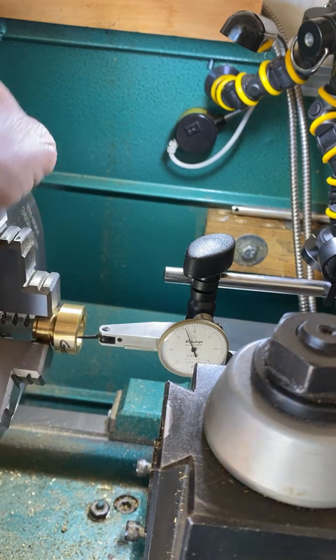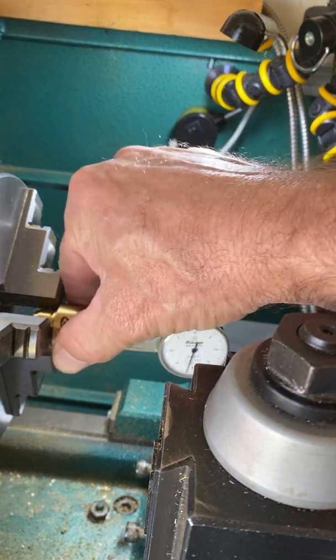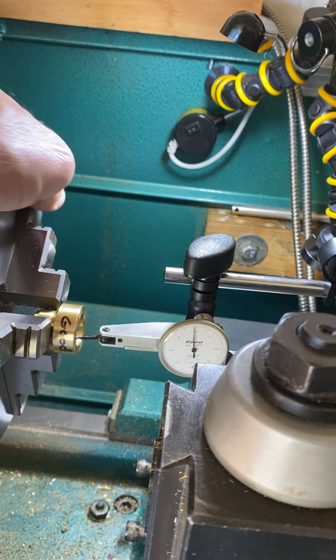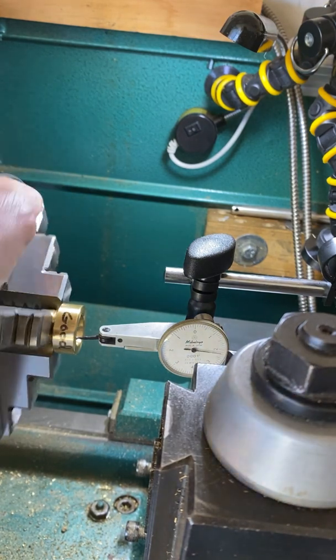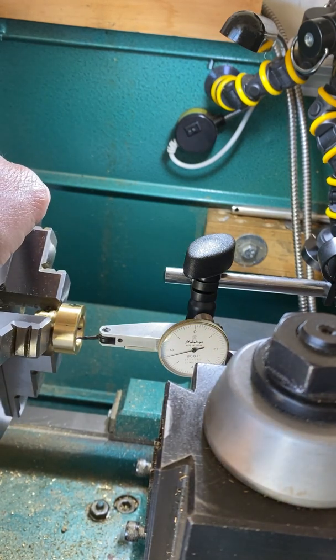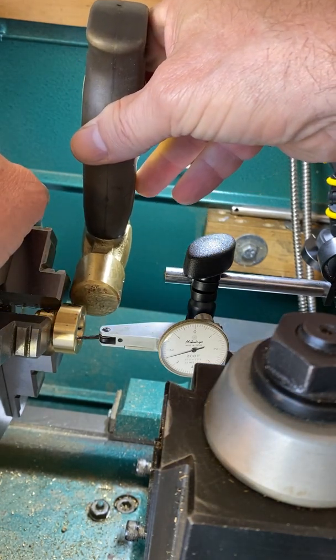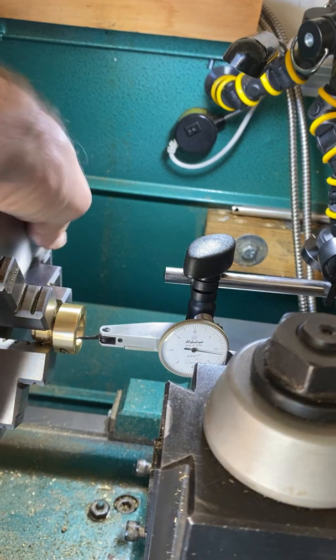Way out — that means when I put it in the chuck it was massively off, which is fine. I can see already I wasn't even close to right. I'll set it back to zero and get the indicator tip to touch again. See how far off we are? A whole bunch — I just threw it in there. Now I'm going to go as far one way as I can, then give it a tiny little tap with a hammer to take up about half of that. Much better.